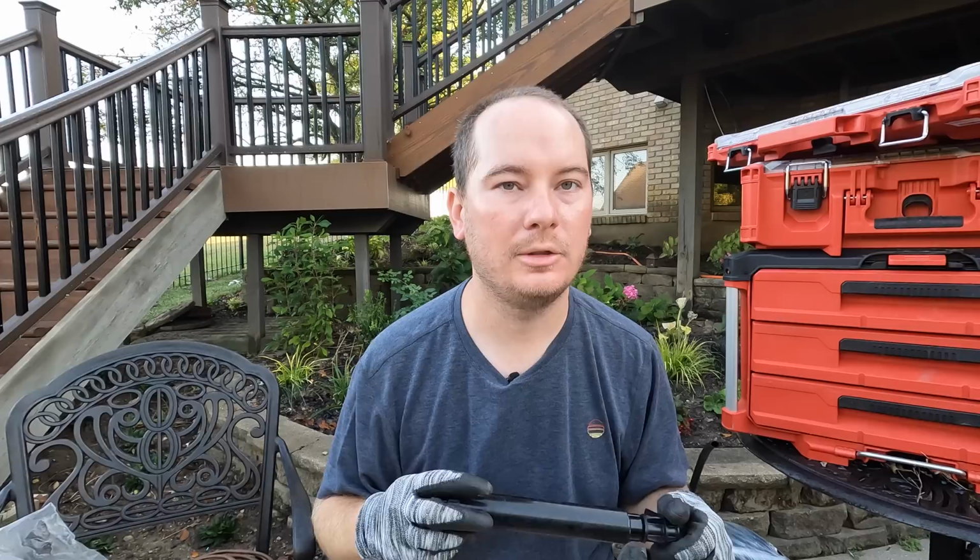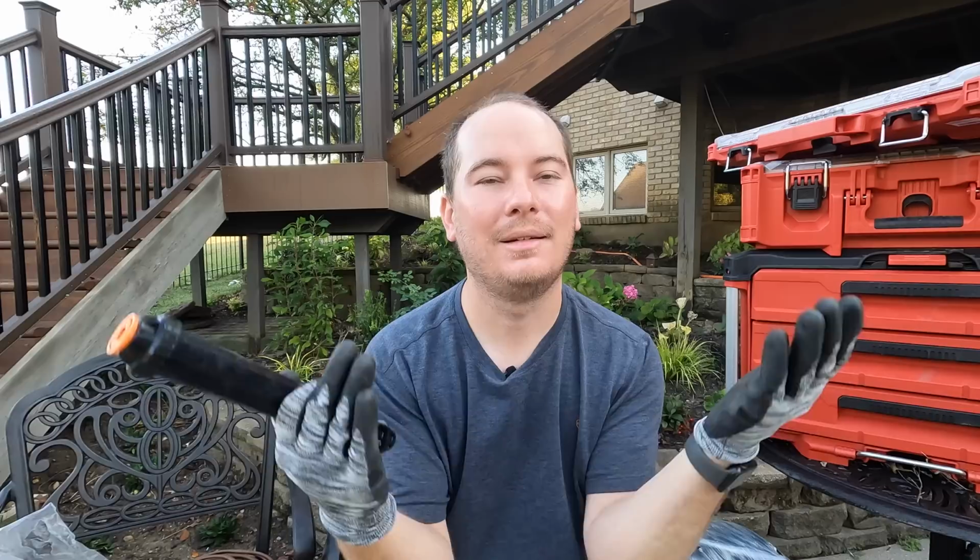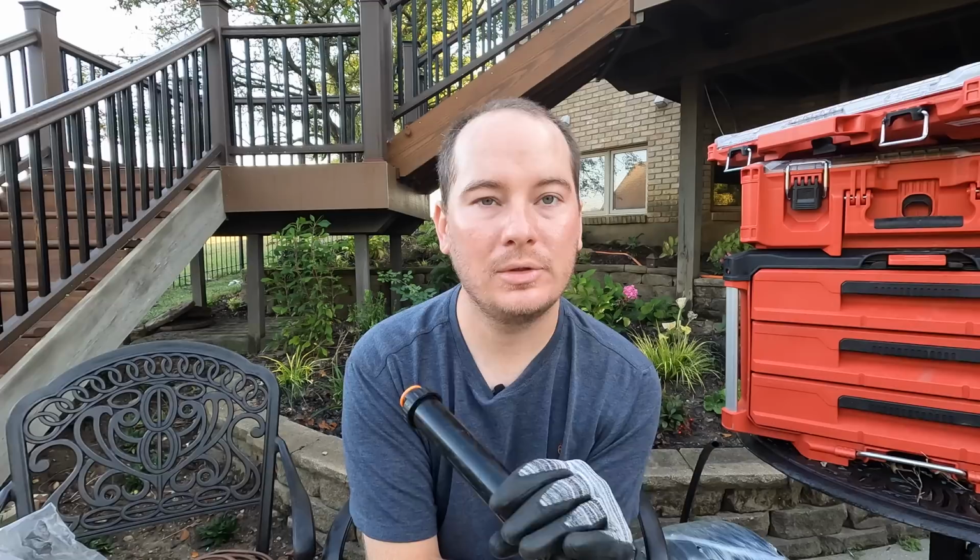From Amazon, probably. But then, these sprayers are really nice, and I would probably put these on their own zone. I did not have these on their own zone at my last home, and so they really reduce the amount of throughput that you can have and the length of tubing, because this is just spraying out water. There's nothing backing up and adding pressure to the system. So you can't use quite as many of these, but if you need to pop one into your drip zone or two, you potentially can, depending on how long. Now, if you have extra zones available, put these on their own zone, and then you can add lots of them if you need to.